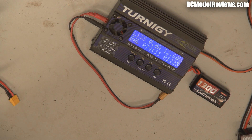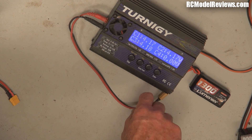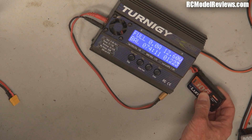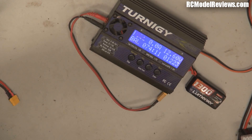Okay, so there we go — we've got it full. It didn't take the full 1300 milliamps. It took 74 minutes, and there are obviously no really weak cells here — it didn't take too long to balance. The pack itself has a little bit of puffing, which is kind of expected if you run them dead flat — that does cause damage. This was overnight because I left it plugged in, didn't realise it, came in the morning and it was dead flat. So if you do flatten a battery below the safe charging level, as soon as the battery is cool, that's when you want to stick it on the charger. Every hour you leave it contributes to the damage taking place inside the battery.